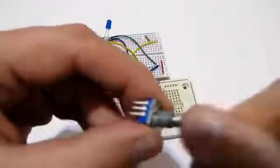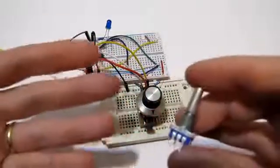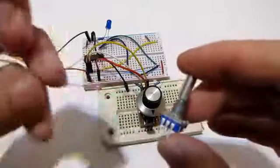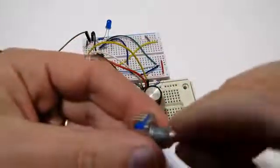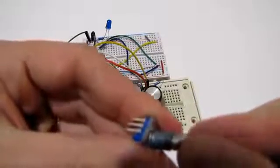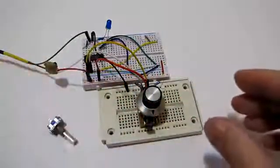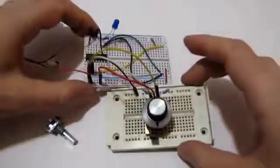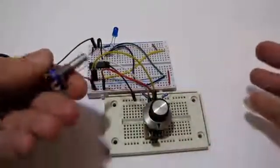That is, no matter what capacitors you choose or what kind of software debouncing you use, you either miss some of the extremely fast signals, or you interpret some of the bounces in the extremely slow turning as legitimate signals. And that was unacceptable on my project, so I set out to build the world's best cheap rotary encoder reader.